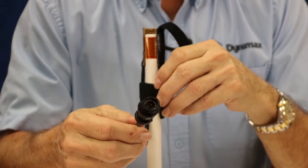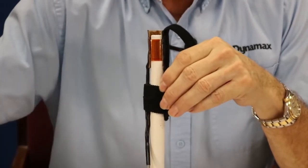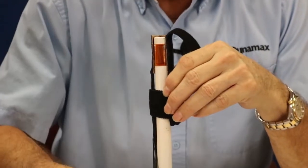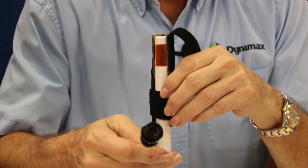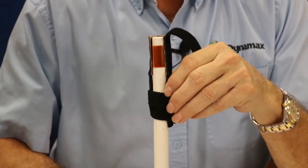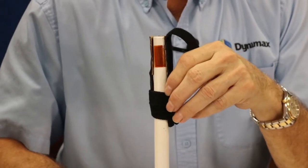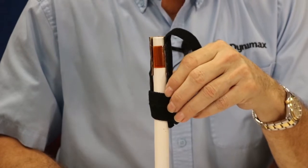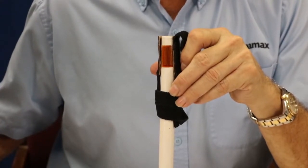So the system connections to the sensor are through a circular plastic connector. That's a 9-pin connector. It's sealed with a G4 grease, this type of silicone grease, and an O-ring that's inside the connector. That has to be there as you connect the data logger. On the ExoSkin sensors, we use the SAP IP CS1 or the SAP IP CS4 connection, and then for the SGDC sensors we use the SAP IP CS3 cable connectors, and both of those can use the extensions, the EXQC25 or EXQC50.